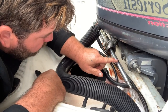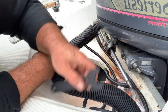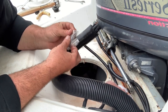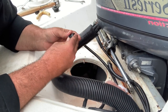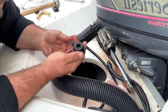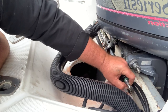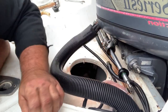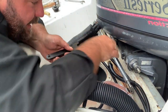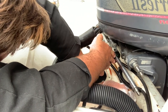Probably going to put a little sandpaper on there just to take those dings out — you want a smooth transition. That ding could cause a leak or rip a seal. Let's get this O-ring all the way down here — there it is, just a little packing thing. Doesn't even want to go over where that ding is. But see how much tighter that new cap is — I can't even turn it by hand because these seals are good. Nice and tight.